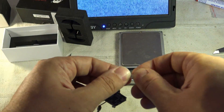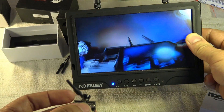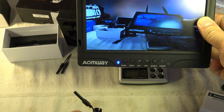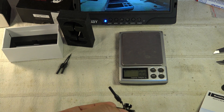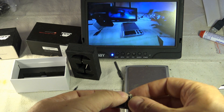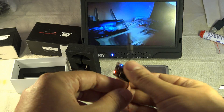The image quality is great. The 120-degree field of view is a good choice — not too wide and not too narrow — suitable for both indoor and outdoor applications. The light sensitivity is maybe a little bit weak; it should be a bit better. We have something around 1 lux maximum. And as mentioned, this module gets very warm, so you definitely need some airflow to cool it.